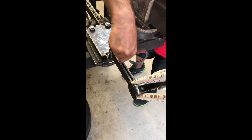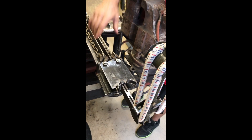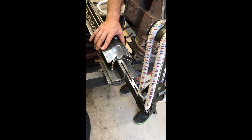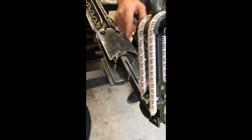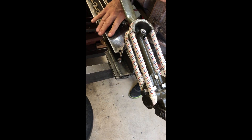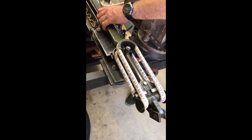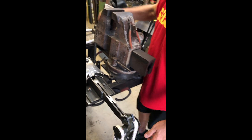As I'm pulling the bungee tighter it creates downforce on the plate which locks in the pin, preventing the bungee from slipping off on its own. Once I get it up over center it releases that downforce tension — there's still tension in the pulling direction but not the downforce — making it easy to pull the safety clip off. I'm drawing now with the come-along, stretching the bungee around the draw plate. I've got this shape cut out to match the collar the bungee has to flip onto, pulling tension just beyond, dropping it in, then popping the bungee off with a pry bar onto the collar.